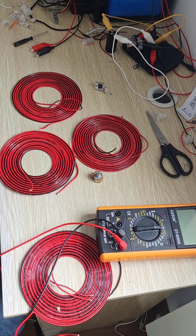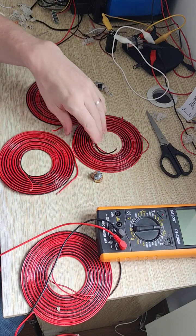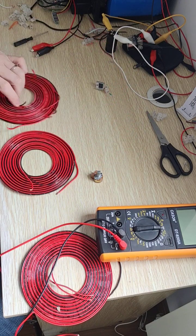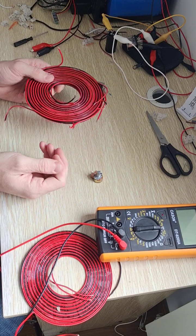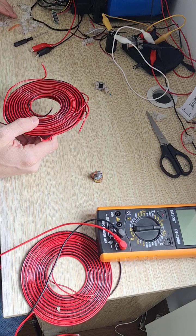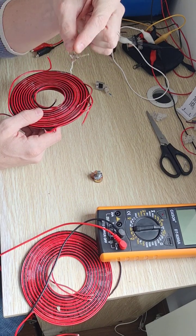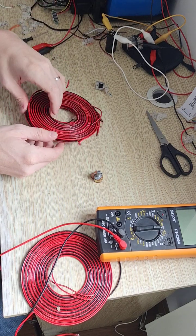And as you can imagine, there's a million ways to do this. So you've got the driver coil, that's always going to be there. You could have 1 pickup on top, 1 pickup underneath, and take separate outs, rectify separate outs. Or use 1 rectifier and connect them at the rectifier and take that voltage. You have 1 on top, 1 on the bottom.